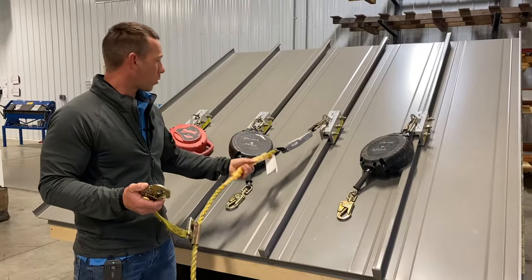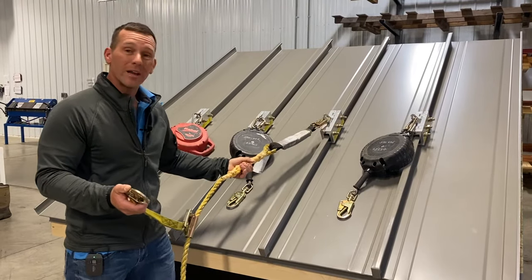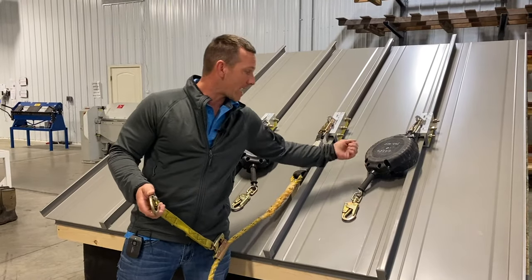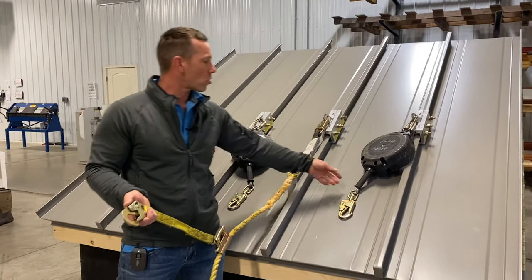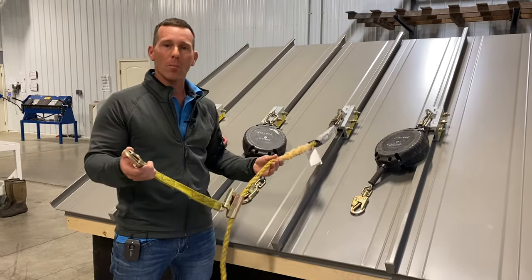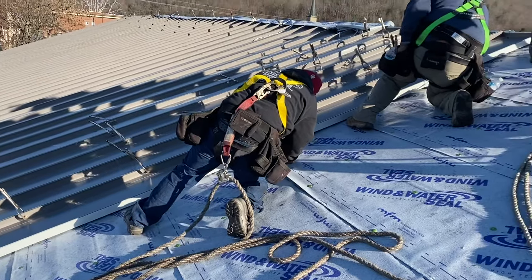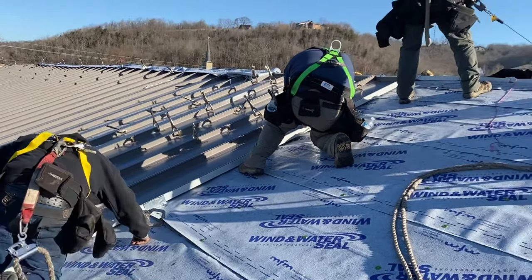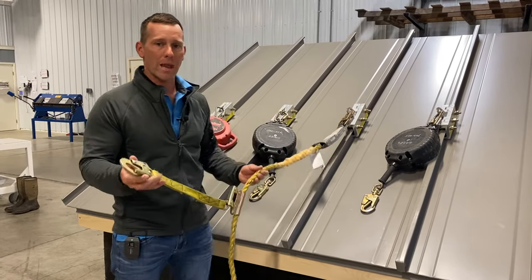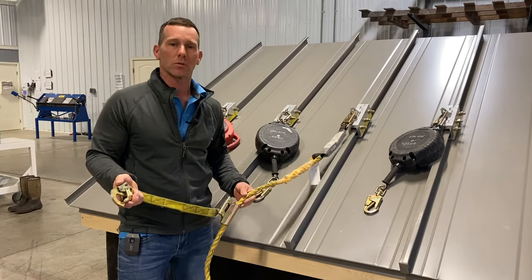Sometimes the old way is the better way, and in this case I'm going with ropes every time. I think we're more productive with ropes - they're cheaper, easier, quicker, simpler. I don't have to worry whether the retractable broke or why it won't engage. There's all kinds of things I can't see going on inside that box. With a rope, I can examine it, test it, see if it's frayed - it's right there. You're going to be much better off, save money, and your crew is going to appreciate ropes more than expensive retractables.